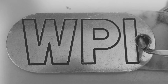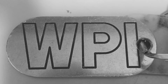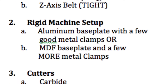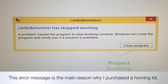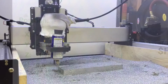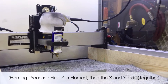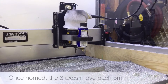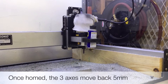From day one I had a lot of error messages where Carbide Motion would disconnect. One of the best options I purchased for this machine was the homing switches from Additive Aerospace — link in the description. It puts five limit switches on XY plus/minus and Z plus, and sets the machine for homing using settings 20, 21, and 22, which are hard and soft limits. Also, a quick tip: I put a sock over my router because I don't want it to ingest aluminum chips — they're highly conductive and will burn out your router in a few days. Change the sock often.